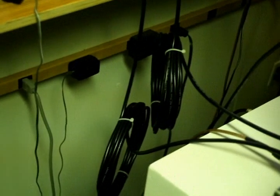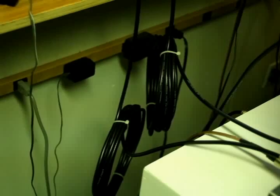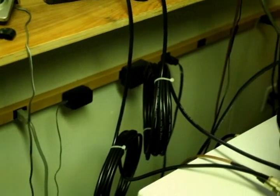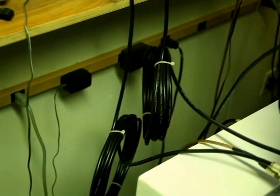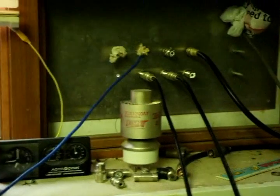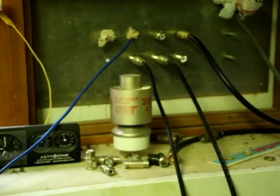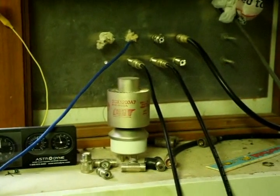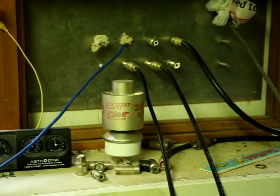We just come off with two equal lengths of 75-ohm cable and a quarter wavelength that are just used for forcing equal currents in the lines. Those two lines run up to the bulkhead panel, and those two lines go out to the antenna.